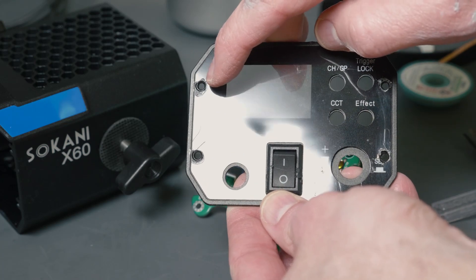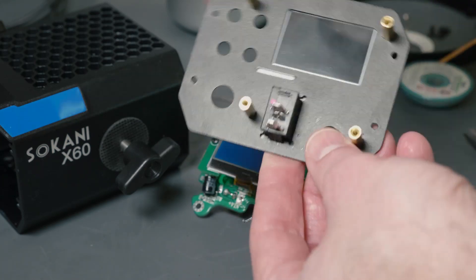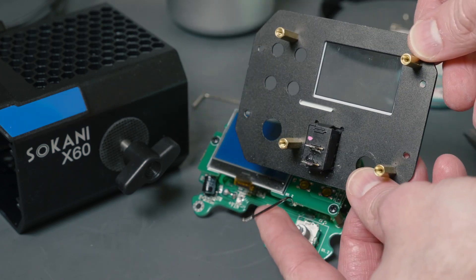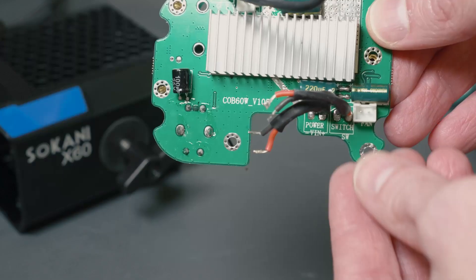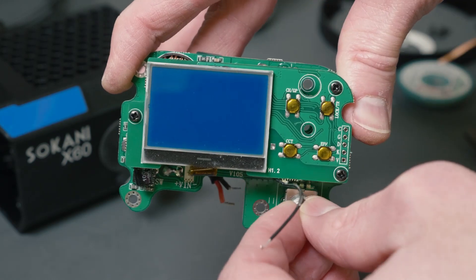You can see this little Wi-Fi antenna sticking out of the front here, and that explains a lot about the really weird remote control that comes with this thing. There's a channel on the inside where they jam the antenna. The only other thing that was kind of a pain is I had to unsolder the power switch and the power input, but those were pretty easy to access and unsolder, and they'll be easy to get back on when I'm done.